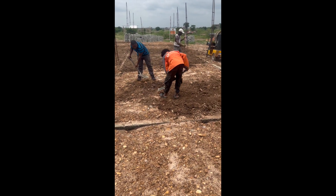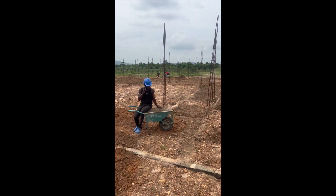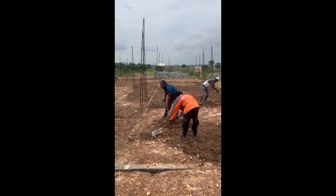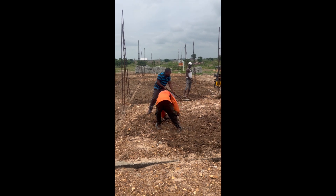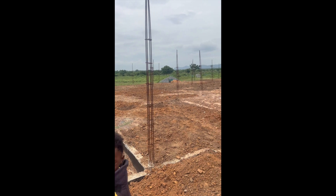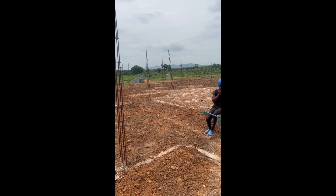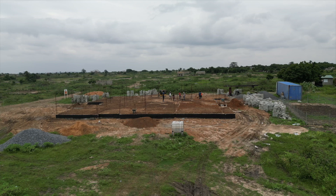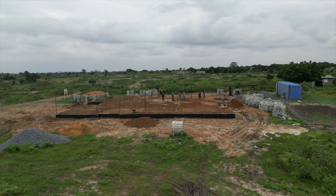Think about it this way. You put a bunch of beach sand, just shovel it up and put it together. When you step in it, your foot is more than likely going to penetrate and go deep into it. But when you compact it and put a lot of pressure into it, now it's harder. When you step on it, your foot does not penetrate the soil anymore, because you've already put all of that force on it previously to make sure that the particles are tightly pushed together.